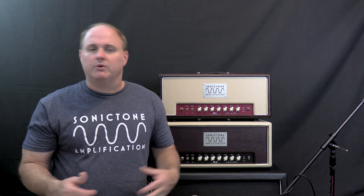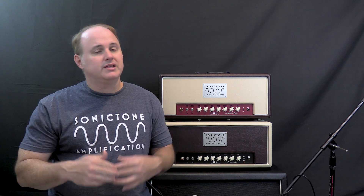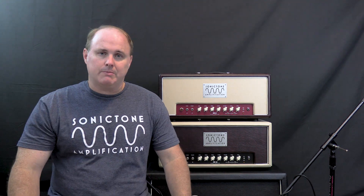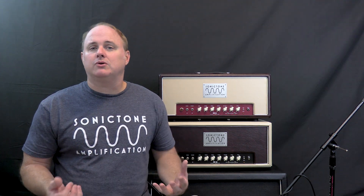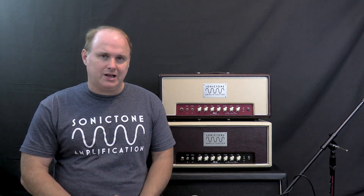So what are the advantages of Class A? Well, typically it's a simpler layout with fewer components, usually with one output tube. Also, it doesn't go into shutoff or cutoff, so the tube's always on, and there's no crossover distortion to worry about. From the standpoint of a guitar amp where it might produce an overdriven sound, there's an emphasis on even-order harmonics and asymmetrical clipping, which some find pleasing. There's also a touch and feel and dynamics with Class A amps that people like.